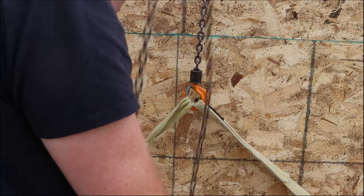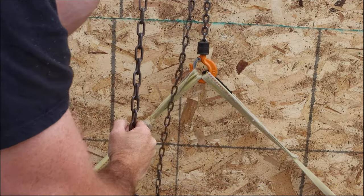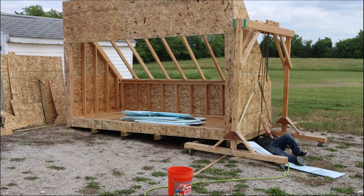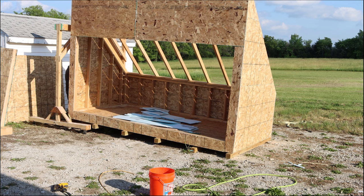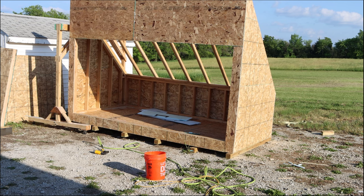Now I have to lift this kiln into the air. I used scrap foam insulation from the poor man's kiln I did last year, and I did two layers of this between each of the runners — these can just get stapled into place. Luckily, I have this gantry that my dad and I built a few years back, and it was perfect for lifting the kiln. We figured out this thing has a weight capacity of about 2,000 pounds, so I made sure to place some car ramps under the edge just in case. This actually worked out pretty well, but I wouldn't recommend it.